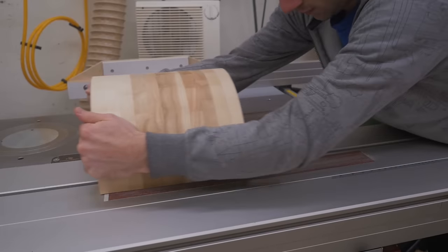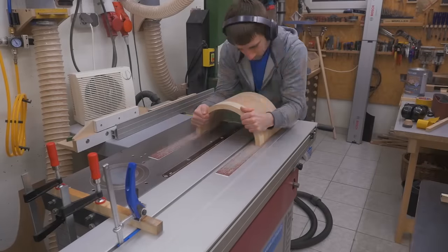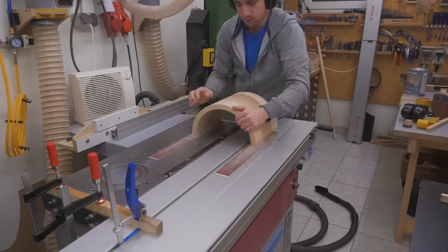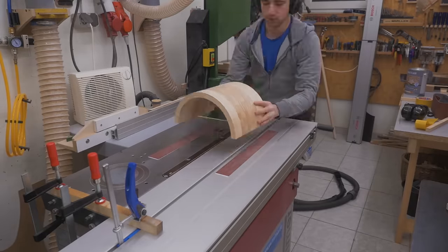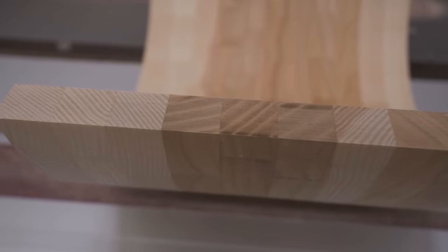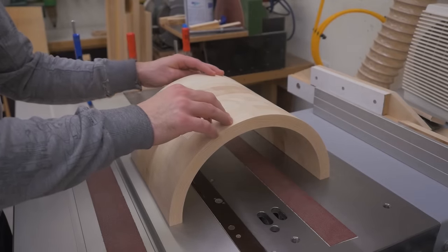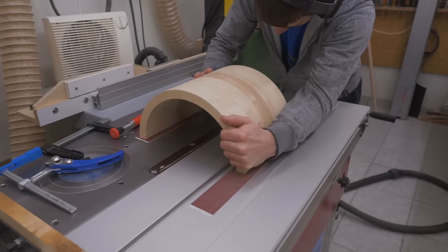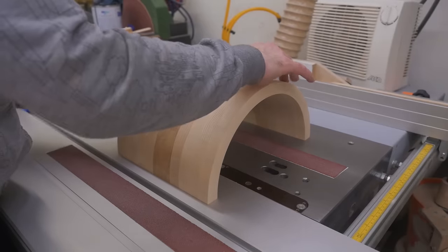After I've spent about 60 minutes with the first piece and wore out the sandpaper, I thought about various different ways of flattening that, but I couldn't really think of anything that would be faster or easier. So eventually I cut up a high quality 40 grit sanding belt and tried that, and it was like a different world. I then spent another 60 minutes sanding the remaining 4 pieces together. The surface was more than good enough and the sandpaper is still sharp. So yeah, use good sandpaper.